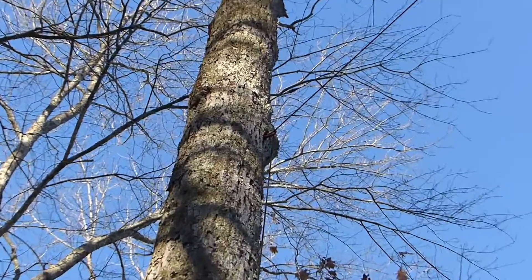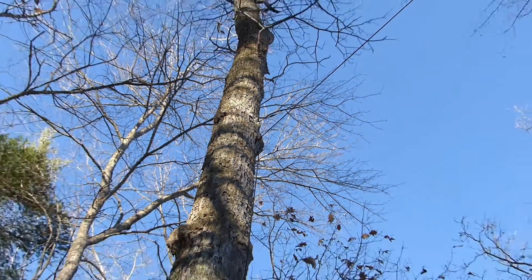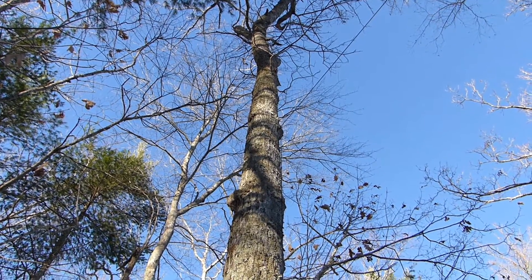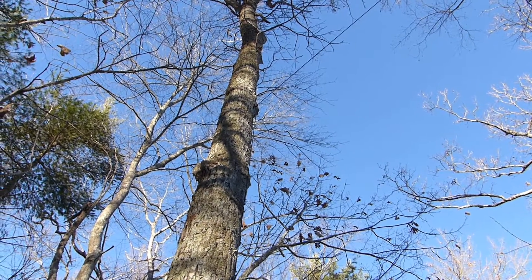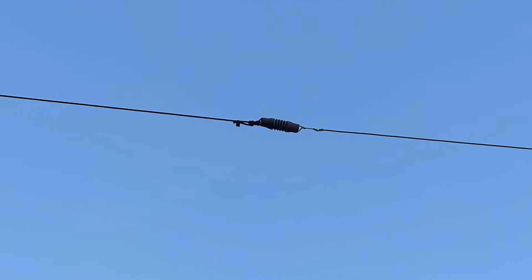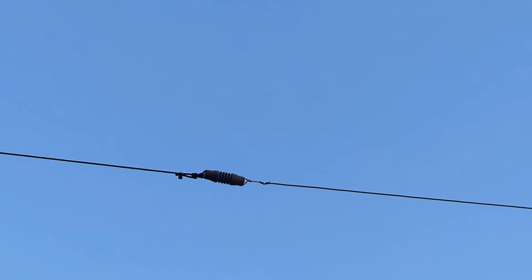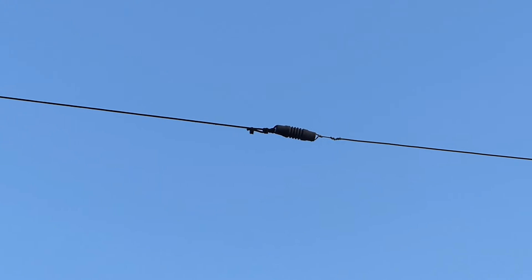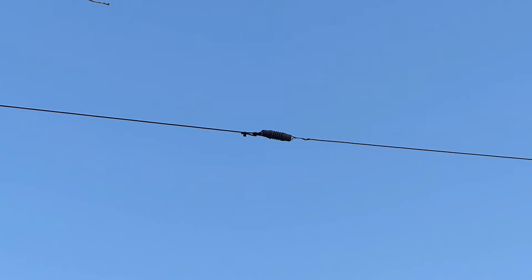The other thing this does is allow the antenna to flex a little bit when these trees sway in the wind. So far, this antenna has been up for about two and a half years and I haven't had any issues with the wires or the ropes breaking. And there's a look at one of the other legs — you can see I've got plastic insulators between the wire side on the right and the rope side on the left. Even though those are just plastic insulators and the sun has been beating down on them for two and a half years, they seem to be doing okay with no issues.